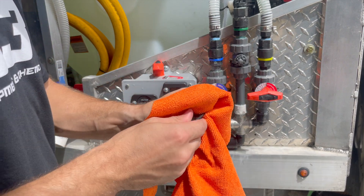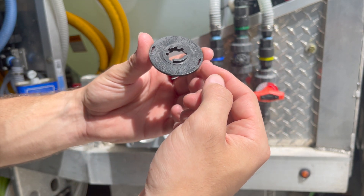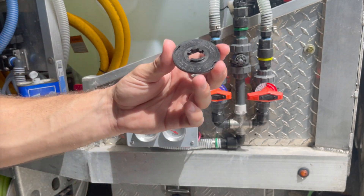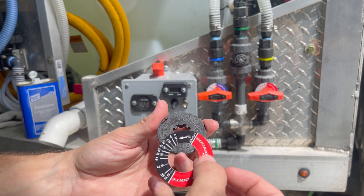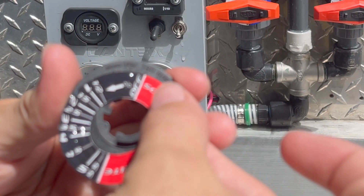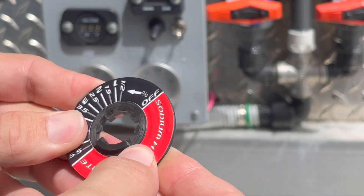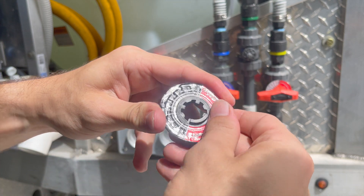Take another rag and dry it off, then we're ready to install. You've got a bunch of different markings on this plate — zero all the way around to 180. Make sure your arrows are facing up. I'd recommend sitting down at a desk for this. You want to align the white line and the off/fully open mark with the zero degree mark, get a good general idea of placement, push it up, set it into place, then work your way around it to get it seated. Once it's on, massage it in to make sure it gets into all the grooves and sticks really well.